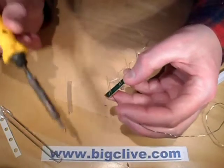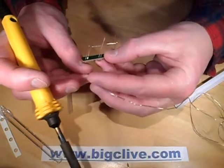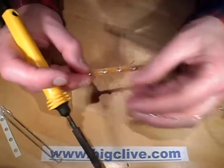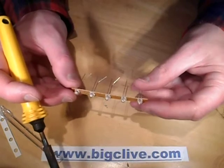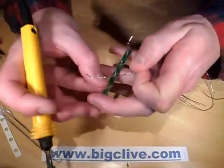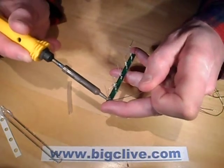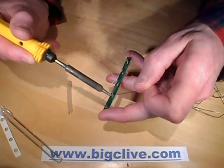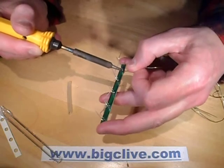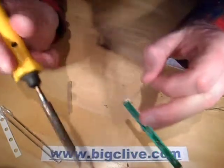It's not that hard to do. It's not as easy as taking the LEDs out — the silicone aquarium tube trick is very, very good for that. So that's all the anodes soldered. Are the LEDs sitting square? Yes they are. So I'll solder the rest of the connections now, which is easier because I don't have to hold the LEDs in at the same time as the circuit board and the solder. That's 1, 2, 3, 4, and 5. I'll also put a wee touch more solder on the points that the wires are going to reconnect to.